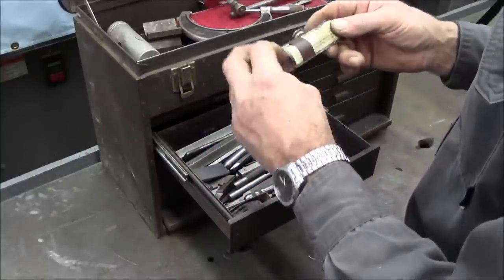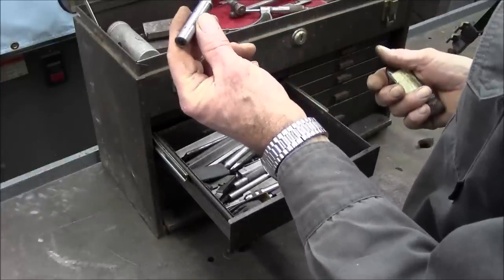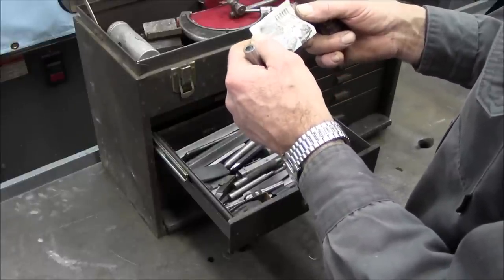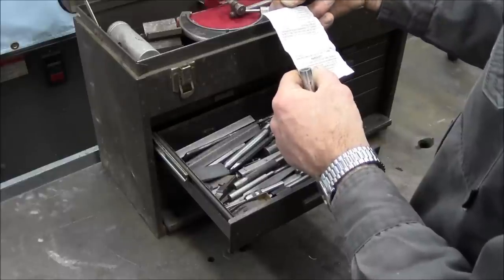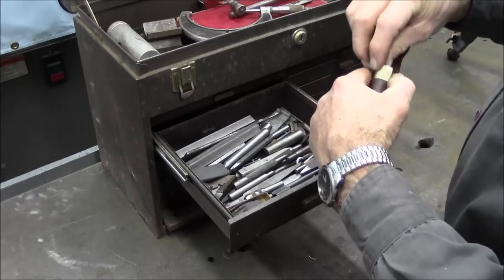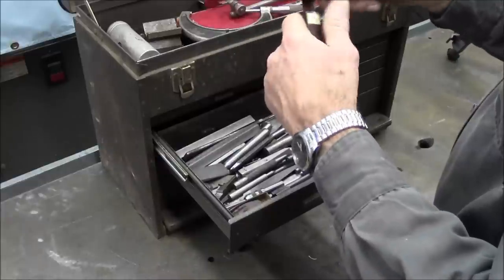Center finder — Micro. Still moves. I have so many straights and quarters but I don't have an actual cone shape. This has the scissor in here also on it. At the moment it tips or jumps approximately to the side — that's when it's on center. I'm going to cover that because so many guys think that when it's off center and just comes back to where it lines up, that's zero. But it's not. It's not zero until it jumps. You gotta find that sweet spot.